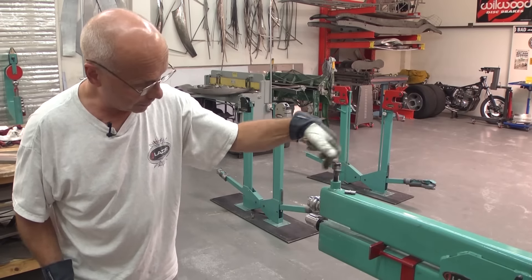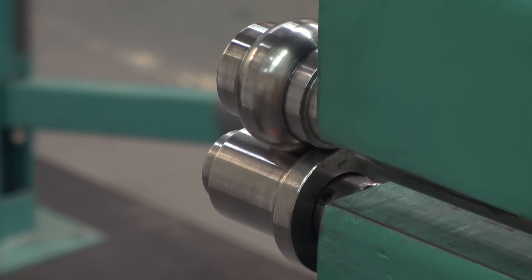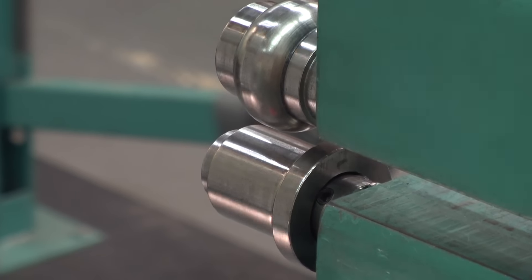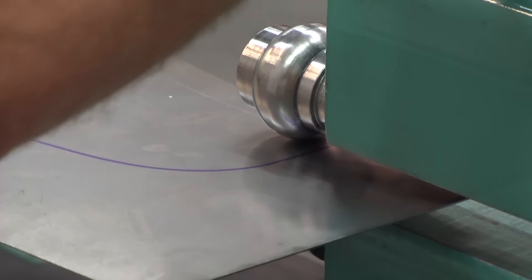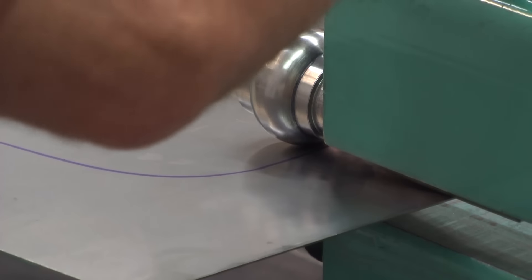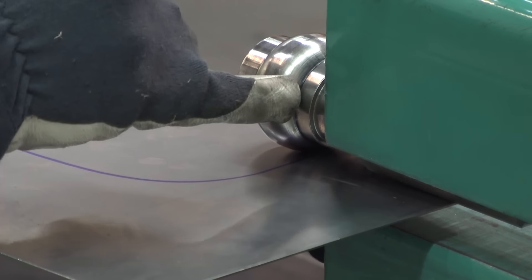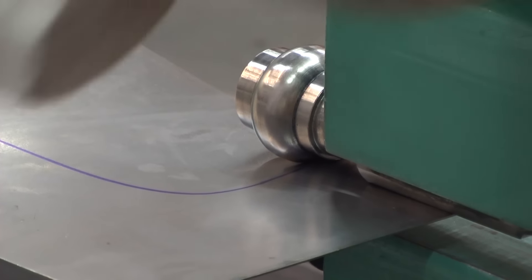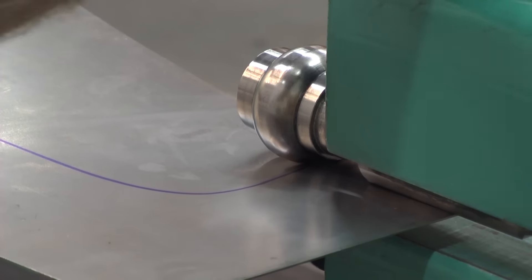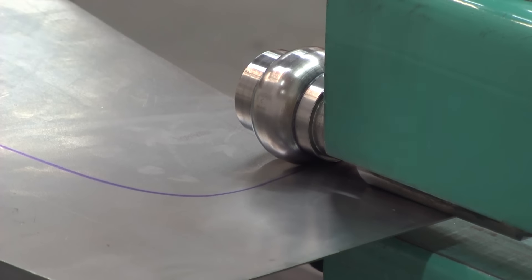This is the die combination I'm using in the bead roller — two dies that are not normally a pair; one from one pair and another from a different pair. This is a little critical so I don't want to do this in several passes. I set the bead and the groove in the center of that blue line and crank it all the way down until I feel resistance, then back off a quarter of a turn. I need to go slow to maintain control, and always stand on the side as it feeds in.